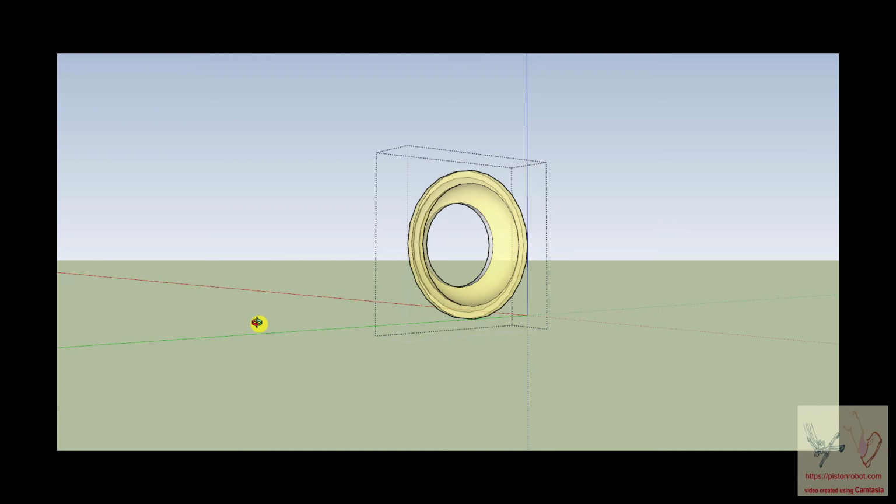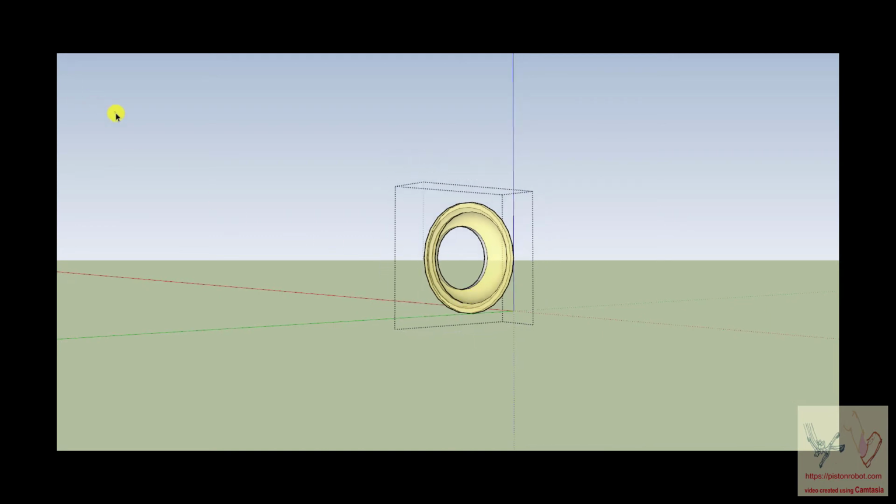I like the idea of boron nitride. Boron nitride is weird. It's almost like magic. It's very hard, very strong, very resistant to temperature. It's a ceramic, but you can deposit boron nitride with a vacuum deposition plasma jet. So you could make a press, a die, and get it extremely highly polished, and then deposit boron nitride on it as a ceramic and get a very nice smooth coating, and it would stamp out these little metal parts for you inexpensively.